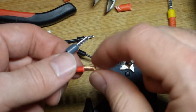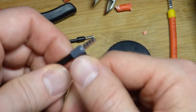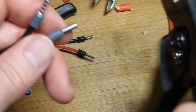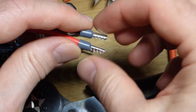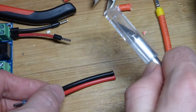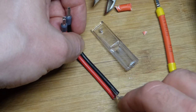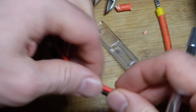You probably want to put the tool at the same angle so they're facing the same direction. Now I can strip this end — the ferrules will hold the strands in place so we won't have a bunch of strands popping out. I'm going to pop the cap since I'm using one hand on the side that's away from the blade. Quickly score here. Once you get a score — I believe I may have drifted off the path, so I'm going to go again.